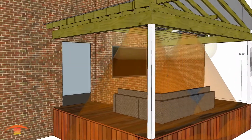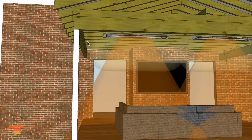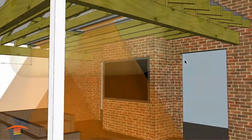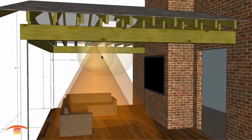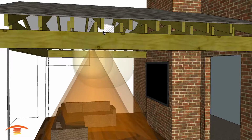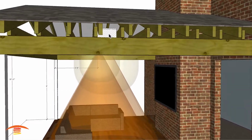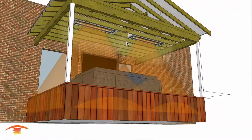Just to go into your clearances here real quick, you can see the clearances are no problem over here, no problem over here, and it's very important though that you meet the clearances. These are the below clearances with the flush mount kit frames. They will alter the clearances because of the 1 hour fire rated drywall that you're using. So I think that's about it.